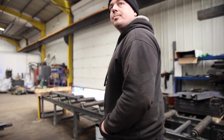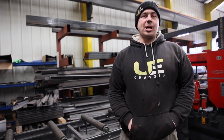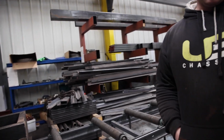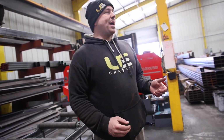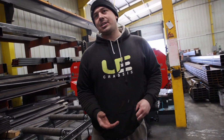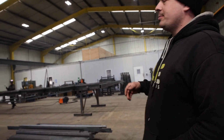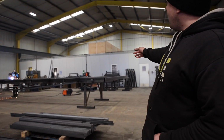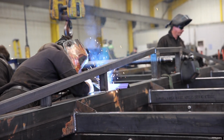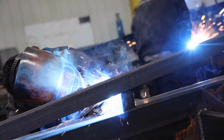So how do you prevent too much wastage? Careful planning and material choice. One of my biggest things is wastage, basically. A full scrap bin is us not doing our job quite right. So I've spent a lot of time reworking materials back into the design, like smaller angle sections for the supports, and you can always use a lot of stuff on other bits. And obviously all the 120x60 sections, we can cut that down to as small as 98mm. My smallest component is 98mm. Oh, okay, so I can almost infinitely use things.